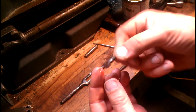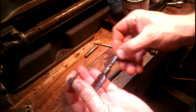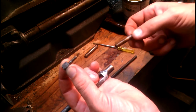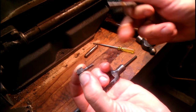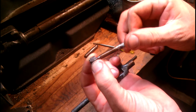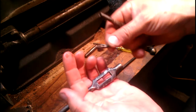I'm gonna flip it 180 degrees — I'm pretty sure that's the way it's supposed to go in. So you've got left-hand threads there. I cleaned this up a bunch but it keeps bleeding rust. And then you've got right-hand threads on the outside of this, so as you turn this in, this one's coming out. I counted it — it only takes about five half-turns to run this thing clear in and out.